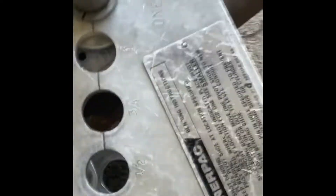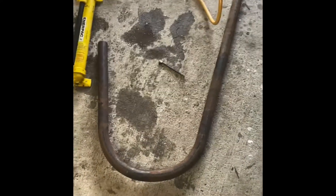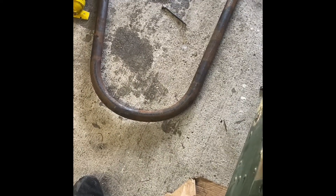There we are — a hair away from 90. We're at 90; we need to go two or three pumps over for springback. There you go. Well, it's out — that's not quite 180 degrees, it's a little less. But for schedule 80, doing it by hand on an inch and a quarter or inch and a half piece of pipe, there's no kinks, there's nothing. I think that's pretty damn good.